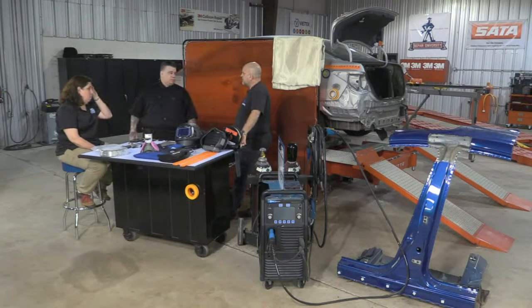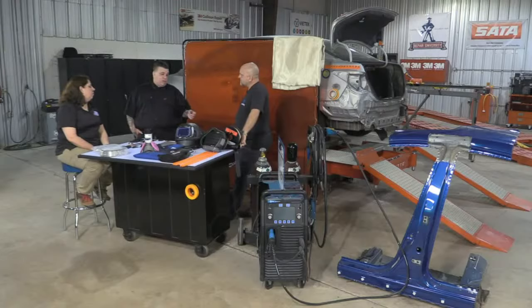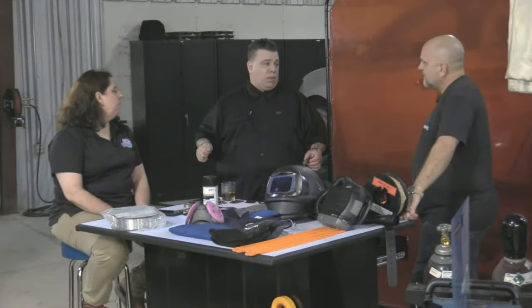What about modules? What if I've got a module in an area? You should disconnect those. I know I-CAR for years has said within 12 inches. I'm a 24-inch guy. Within 24 inches, unplug it or remove it from the area. So at least if it's within 24, just unplug it. You don't want to short the ground. That's the biggest issue.